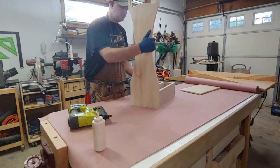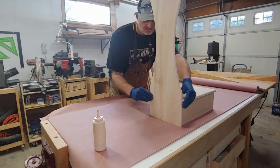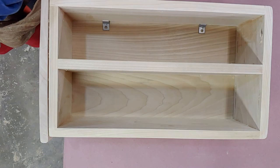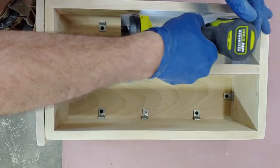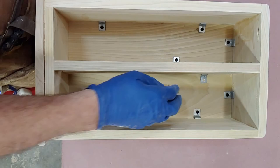Oh wait, I have to do more work. Here I'm taking a slot cutter to put some Z clips to hold the top step — the top piece — onto it. I cut a few little slots in there. My step board was a little bit warped, so I have a few extra slots on one side just to hold that warp down. I pop my Z clips in and screw them down to that top step. Holds it in place and allows for expansion and contraction — which is something I pay attention to.